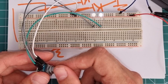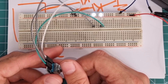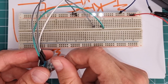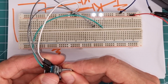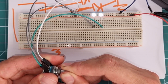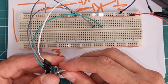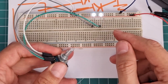Look at these LEDs — when I rotate the handle in any direction, both LEDs toggle, and at any moment both are on or off together. But if I turn the handle slowly, you will see the difference: when rotating clockwise, the first LED turns on or off before the second one, and when turning counterclockwise, the second one turns on or off earlier.